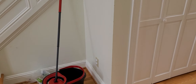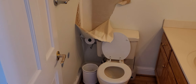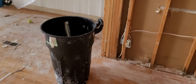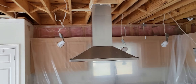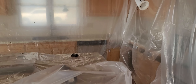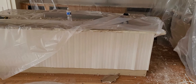This is the hall bath — it has to be completely demoed. Everything's wet in there. You can see where the paint just comes off in big giant sheets; that's usually caused by primer not being used on the front side. This wall's wet, and as I move you'll see why I'm concerned about the cabinets — there they are. So we're going to finish opening that up, take out the insulation, probably remove the backsplash, get some airflow, and hope for the best. Like the floors, we'll probably have to take them out, but I'm trying my best to save the customer everything I can.